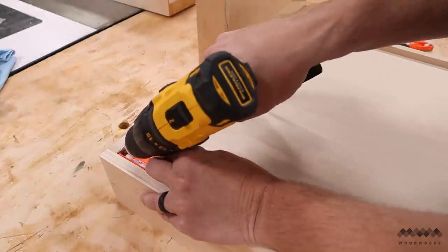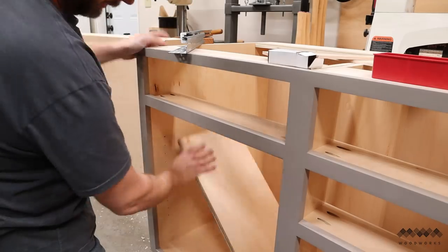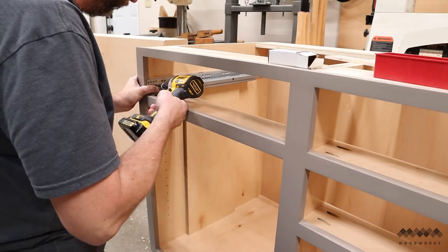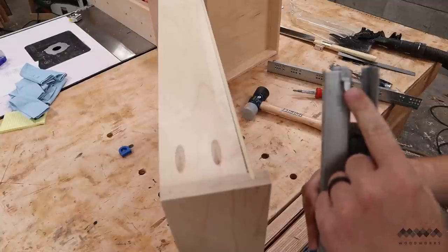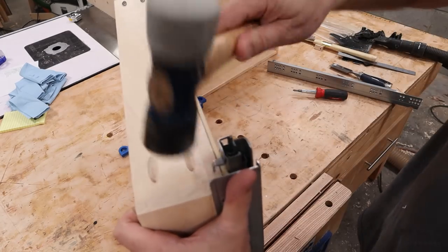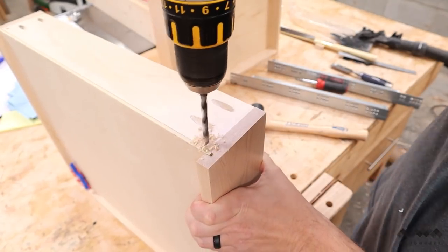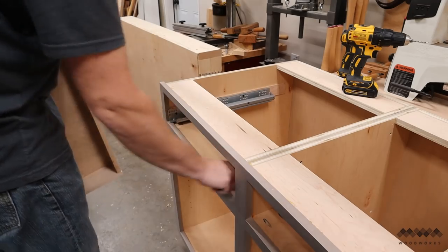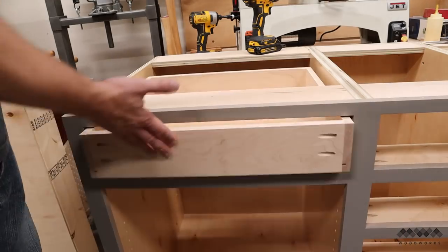With the face frame in the clamps, I went back to the drawers to install the slides. Since I'm using undermount drawer slides, I need to install these little clips under the drawers. These undermount slides are really nice to install. I always thought they'd be harder than regular side mount slides, but they're actually easier because they have so much adjustability. They do have little tabs on the back that you need to drill small holes for, but locating these holes is actually pretty simple — just set the drawer slide on the drawer where it's going to be positioned and tap down with a mallet. Some people make special jigs for this, but I find this method just as easy. Once you drill the holes, you can test your fit, and then set your drawers onto the rails and press until you hear the click. The drawer is locked in and ready to go.